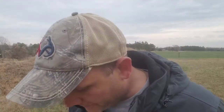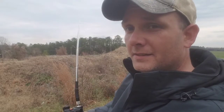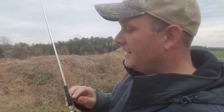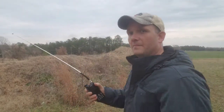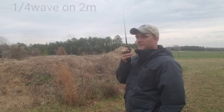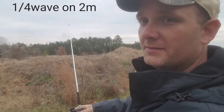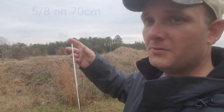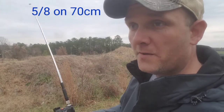This is what I did because I like my Smiley tri-band antenna. This thing has a springy spring on it. It's VHF — look at that. Quarter wave on two meters. 17 inches long this thing is. Drop it down one, two — guess what that is. Five-eighths wave on 440.